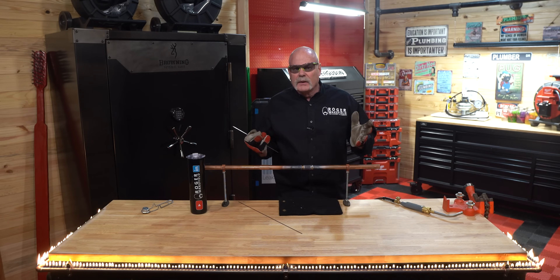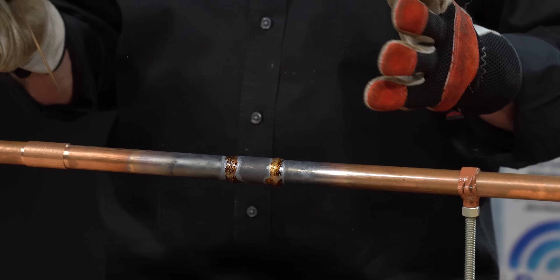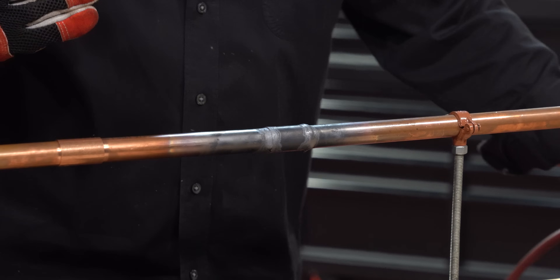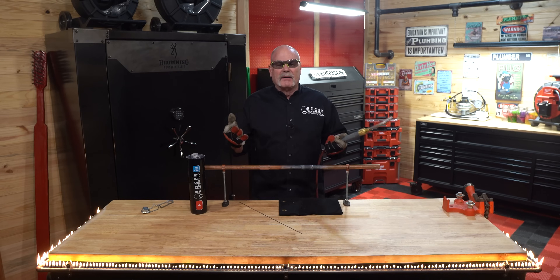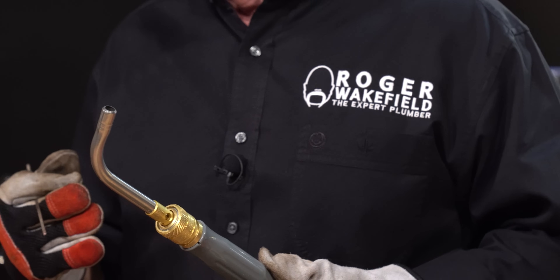This one here I capped a little bit; this one I didn't as much. Now, if I was doing a med gas joint, I'd have gone a little hotter and a little deeper — for med gas you need full penetration, especially for the state exam. So that's a TurboTorch — that went pretty quick and easy. The thing I like about this: get the right size tip, turn it on, and you're ready to go. Your bottle of acetylene is going to last you a good long time and you're going to be able to get a lot of joints out of it.